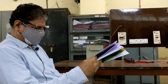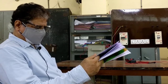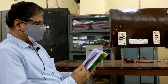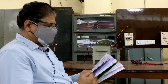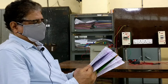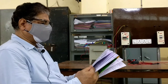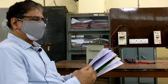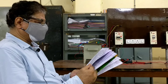This test is generally carried out with the help of a turns-ratio meter or voltage ratio meter for accurate measurement. However, it can also be performed by injecting a rated LV-side voltage at the rated frequency into the HV winding — the principal or main winding — and the output is measured at the terminals of the LV winding. For such measurement, the output voltage at the LV side is measured using a precision voltmeter.